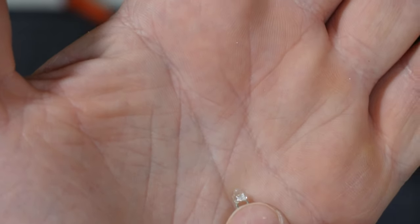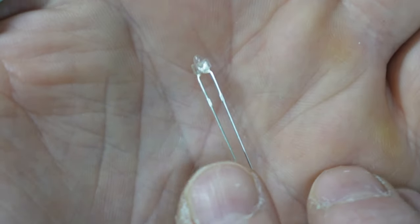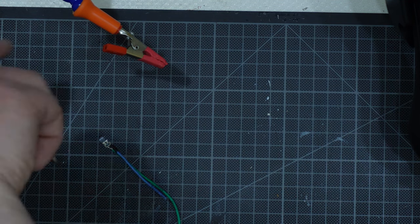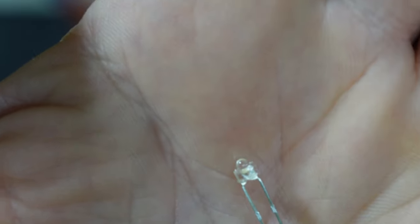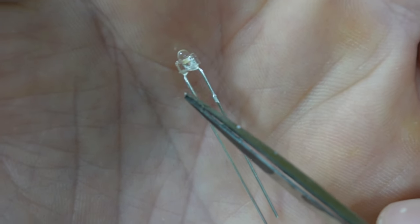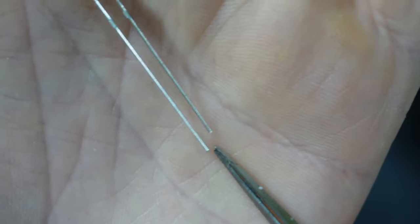It is simply the tip that is different shaped and dimensioned, but the legs are standard dimension. And generally I cut where is here the point here. Let me get in focus. Minimum length you need to go where it is marked there with this flat, okay, there. But I've even cut shorter when I cut those legs, okay? And obviously the long one is the positive and the short one is the negative.